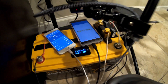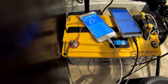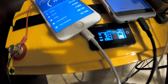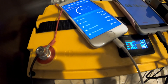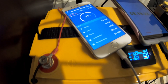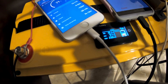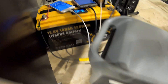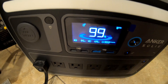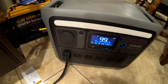Just a quick update. We're about eight hours in and we still have 71% remaining. The Victron shunt and the built-in shunt in the battery both match — both are estimating 71%. The voltage matches. The current is slightly different: the Victron shunt is saying 9.5 amps and the shunt in the battery is saying 9.7. Close — just a slight difference there. This is working great. The fridge is on, pulling 96 watts, and we're putting in 126 watts from the battery, so it's just keeping this power station topped off. It's running the fridge great.